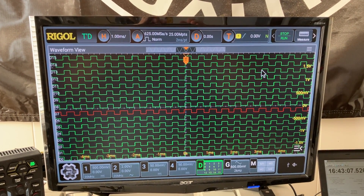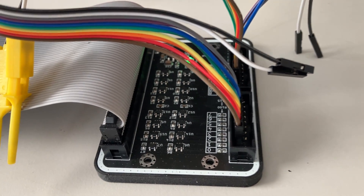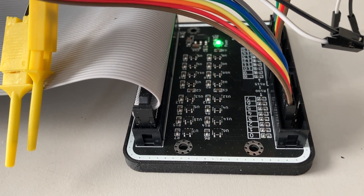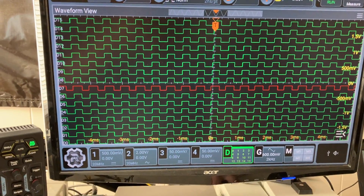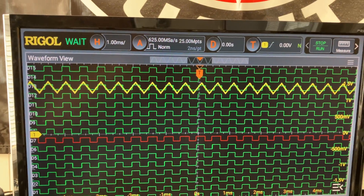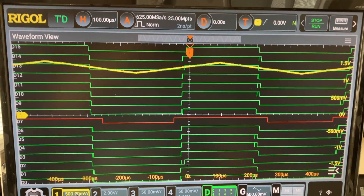This is not an art form, it's just a test. The test is to see what is the trigger level — the half duty cycle — for the LVDS driver to trigger. This will give you an input of where to set an offset if you need to. Basically what you're doing is simply inputting a triangular shape. Let me show this shape — it's a triangular wave with an offset. Let's change the time base a little bit to highlight it better.